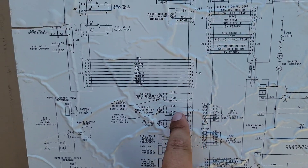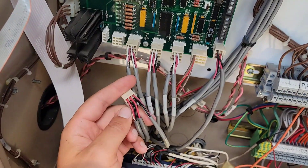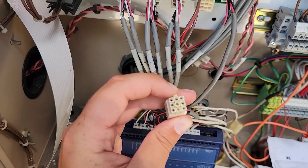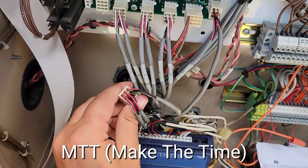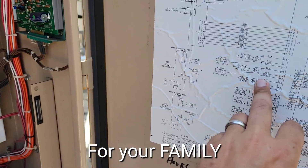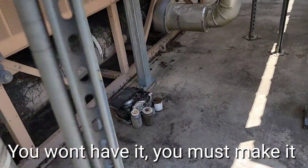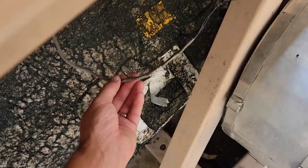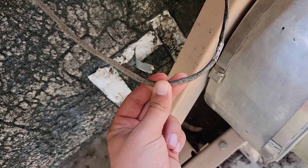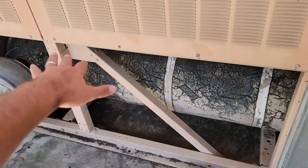J11, yep, right here. Leaving and entering. I've got the tools to slide in there and try to get those pins out and replace them. I'll take you through that process and we'll get all this set back like factory. That one plug does have the outside air sensor that's not having a problem. The rats came in here and just demolished this harness.